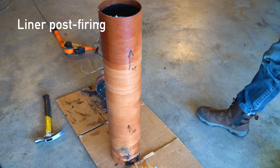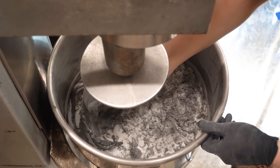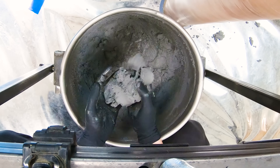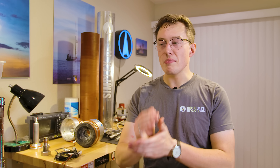I knew intuitively it made sense to not seal anything there and let the hot gas pass through so it could pressurize the case first, but it just felt spooky. You can see the scarring on the outside of the liner and the inside of the case when we pulled this thing apart — that scarring is normal and intended, and it's what we want to see. Apart from the design things, we royally mixed up the propellant mixing process. We ended up with a third of the motor having massive voids, and we had to cut it off to fix it. I'm so glad this motor worked and that we were able to cobble something together out of it, even though time after time we messed something up or hit a roadblock. This is what engineering projects are all about. We have so many more motors to build before this space shot, and each one is going to be built a lot faster than Simplex.